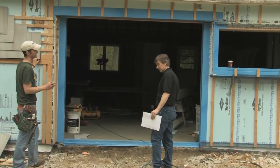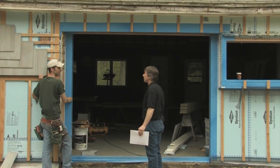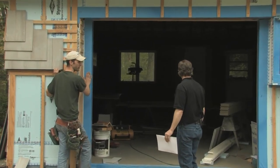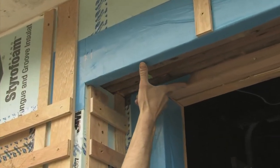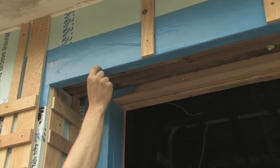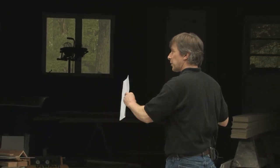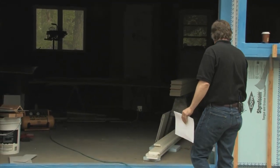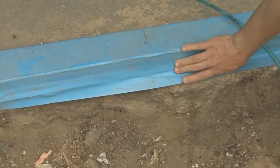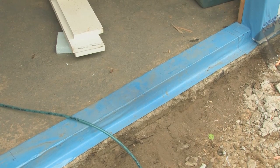This is interesting - because we don't have any room up top for a head casing, we're not going to do side casing either. What we're going to do is a flat piece of fiber cement soffit board, about a quarter inch thick, coming out across the top. The shingle siding will come down and overlap this edge, so it'll appear like the whole head is part of the siding and the doors will just be built in. We also have sill flashing down there. You'll notice that we overlapped the foundation and came down over the concrete - we just wanted to separate the building from the not-building as much as possible.